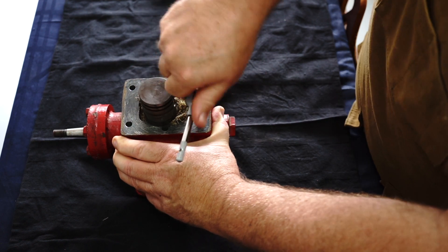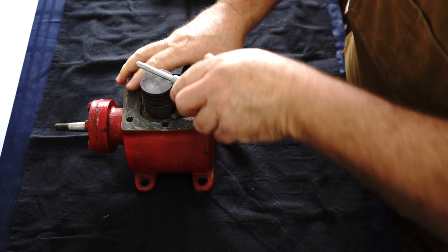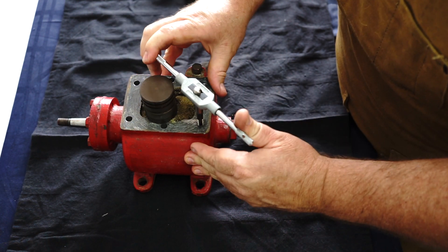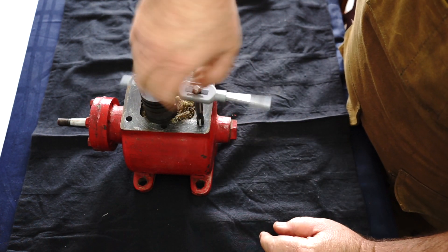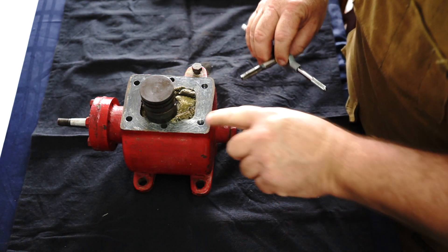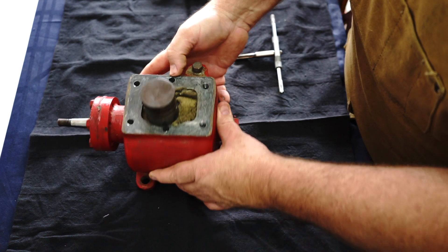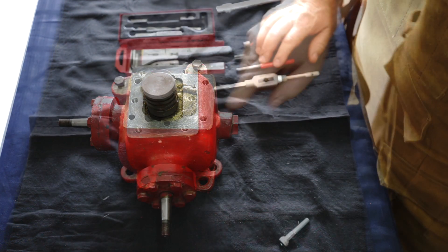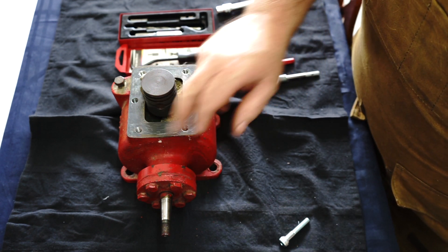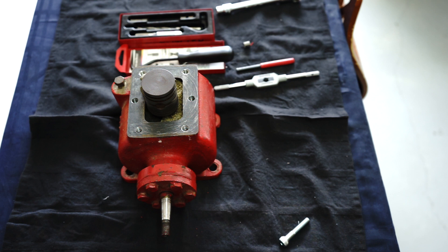Occasionally I'll give it a courtesy flush by going in reverse. I feel that's bottomed out — I don't want to force it, so I'll back that off. I'll blow that hole out off camera and come back. It's filled up with junk down in there. I've drilled all the holes and tapped all the holes — and remember, these are all blind holes, not through holes. I've given them a good blowout and clean, but I'll just go over that one more time quickly.